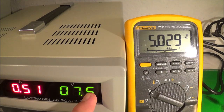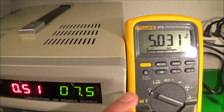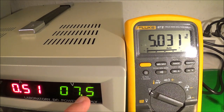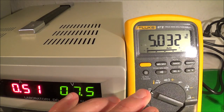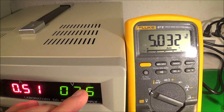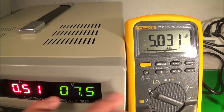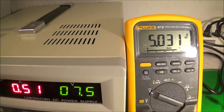Right now we're looking at both input and output: the input is 7.5 volts and it's drawing 0.5 amperes; the output is five volts. This thing has a so-called dropout voltage, which means that if the input voltage goes too low, this five-volt output is going to drop out and your circuit won't be working right. The input has got to be higher than the output — look up the specs for your specific regulator.